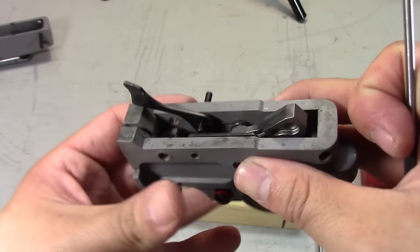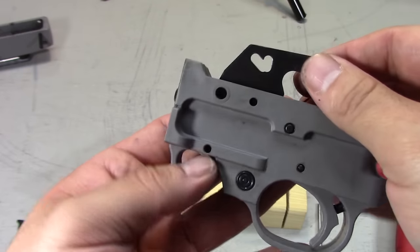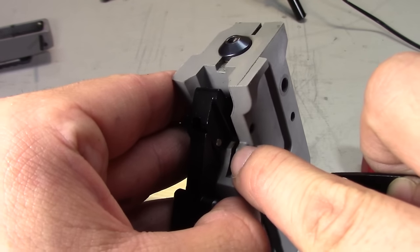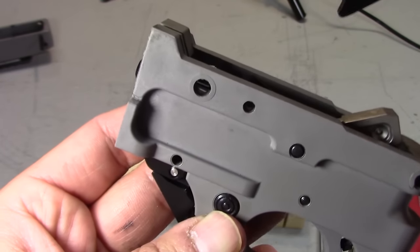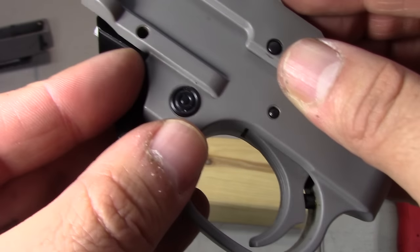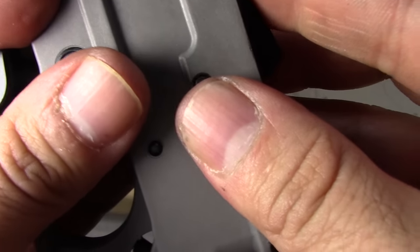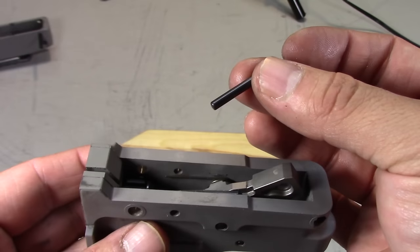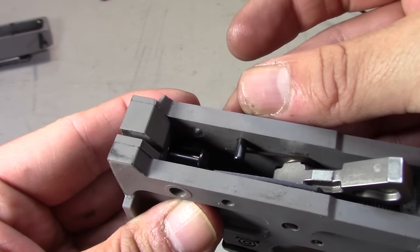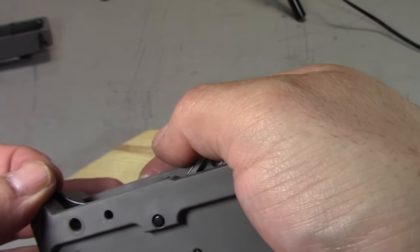With the bottom pin of the bolt release plate now out of the way, all that is needed is to drive out the top pin. Remove the ejector, then simply pull out the stock plate. Reinstall the Guardian plate by sliding it into place just like the stock plate was. The tab of the plate will stick out of the bottom of the trigger pack. Finish driving the bottom pin. Partially drive the top pin back in. Make sure that the bent leg of the spring rests in the notch on the plate and the straight leg sits underneath the pin. Reinstall the ejector. Finish driving the pin all the way through the plate and the trigger pack.